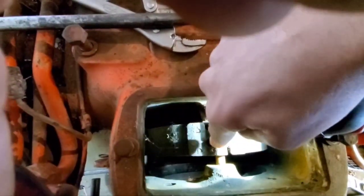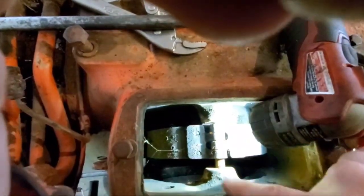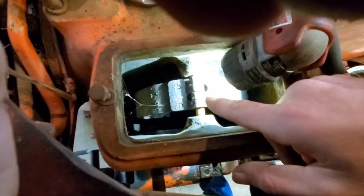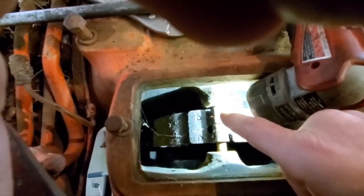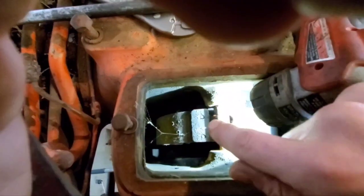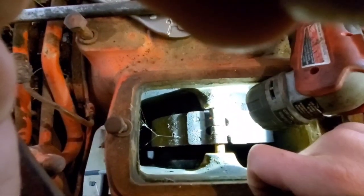Once you get the pads out of there, cut a couple inches of that pipe or that shaft out and then beat the shaft from the outside in, so you get that outside piece out of there. And then you could get a pair of good vice grips or channel lock on the other half and spin that one out, even if you had to grind a couple of flat spots onto it so you get a hold of it, because it's a hard rod.